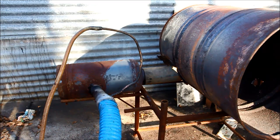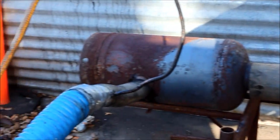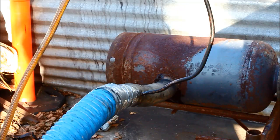We'll see how we go. I've not tried this burner on its side before in a horizontal position, but I know the principle behind it is just retained heat and swirling the fire front around, so I don't think that it will be any problem to operate in that way. I've just used a piece of four inch pipe to allow the burner to blow the heat into the drum because I couldn't actually get it close enough to go in directly. For a more permanent setup I'd make it work without that, but for demonstration purposes that's all it's there for. The oil line goes into the air inlet for the burner and it's simply blown in — gravity feed, no nozzles or jets. The air from the blower just pushes the oil into the burner. It's as simple as that.